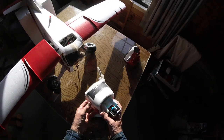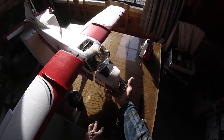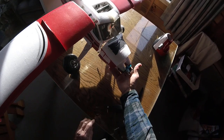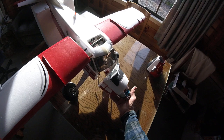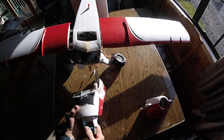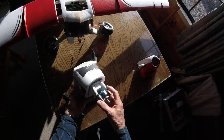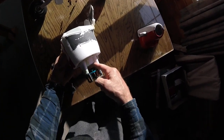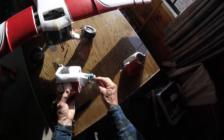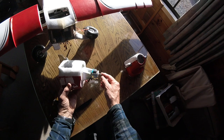One of the biggest things was obviously the impact to the ground. This time the weakest sections showed up — the weakest section in the fuselage with the foam being the next weakest structure. I was amazed at the integrity and strength I've put into the firewall section. The only damage was in the engine mount area here where the plastic had separated and cracked further. It certainly bent the engine mount down because it's got a lower thrust line here.